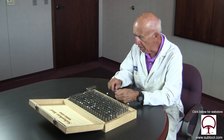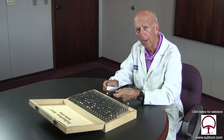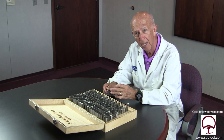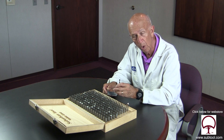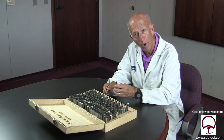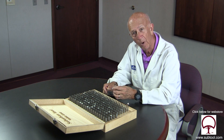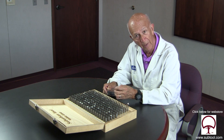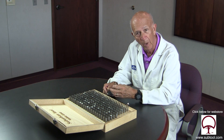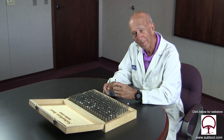So we're going to go back and take our block. We're going to take a brand new drill and drill one hole using the same technique in both cases. The second drill will be the same drill, but we're going to grind the point off center. We'll drill that hole using cutting oil and removing the chip on a regular basis. Let's go give it a shot.